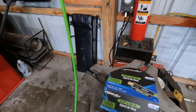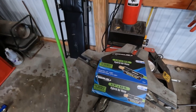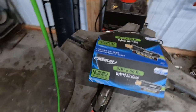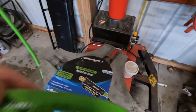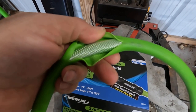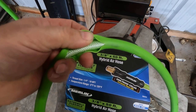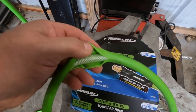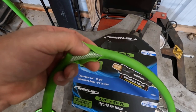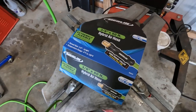When I installed it, it all looked good and I just plugged the air up on it and I heard everything sort of popping and moving — like somebody driving down the driveway on gravel. I sat there watching all these little knots popping out everywhere and then POW, it just blew out. What happened was the hose itself was leaking and the air got up under the outer cover, the shield of the hose, and it just blew out.